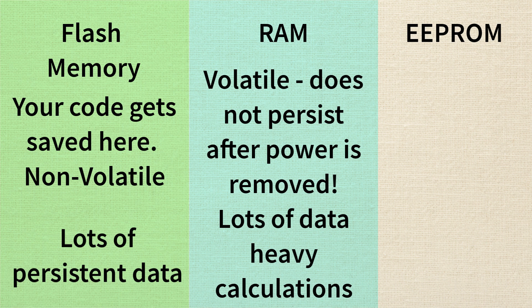There's also EEPROM — electrically erasable read-only memory — which is non-volatile and available on some boards for saving data. It's worth checking depending on your project's scope. Lots of projects can be handled with just the Arduino Uno R3, which has 32 kilobytes of flash and 2 kilobytes of RAM. That might not sound like a lot, but it really gets the job done for a ton of projects.